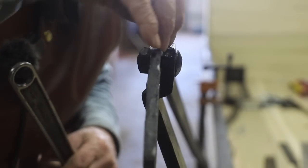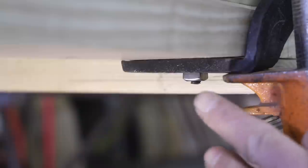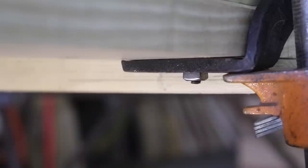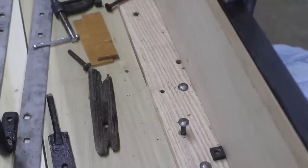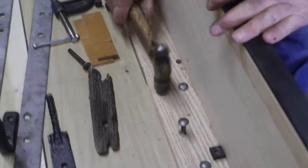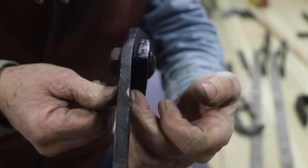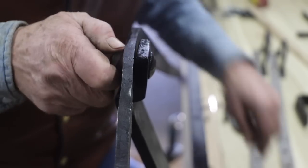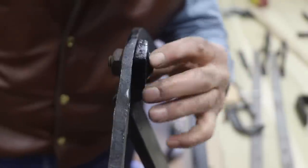I think you can see this start to kind of lay out a little bit as that bottom toe on this iron flattens up against the mainframe. So now with the toe of this iron up flat, I can drill my second hole, and that'll be just right where it needs to be. So now this brace iron wants to hit on the bottom, and there's a gap here on the top. But if I go ahead and cinch this down, you can see it'll go where it needs to go, where this iron was.